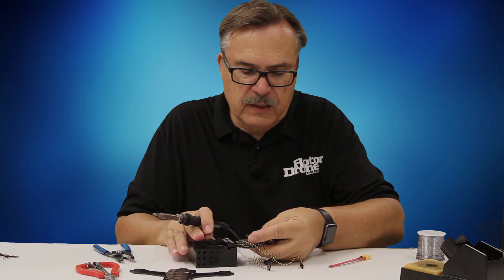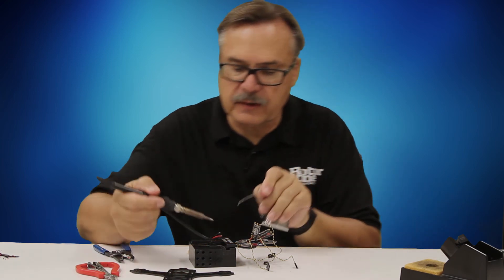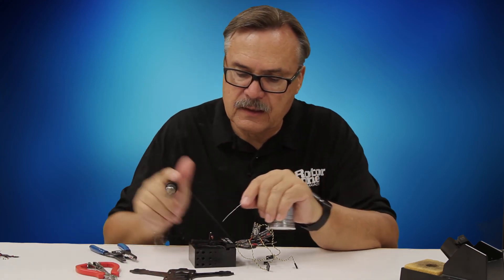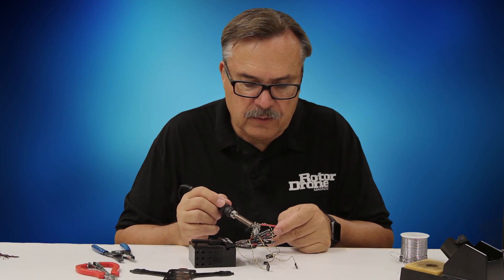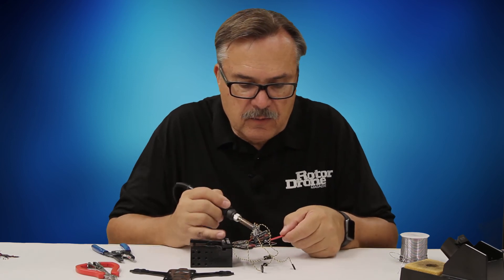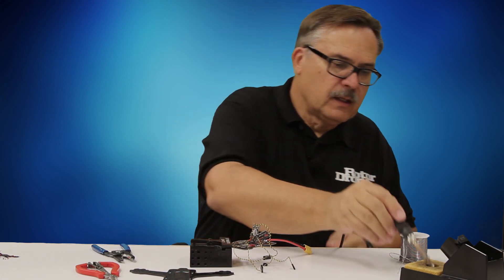Now we can put our battery wire in. The battery already has some solder on it, but I'm going to add a little more because I like fresh solder on there. When they come pre-soldered, you don't really know what solder that is — whether it has rosin core or flux built in. So you want to put your own on there. This one takes a little bit longer because it's a much bigger wire, so it takes a second. It also takes a second to cool down. There — there it is.